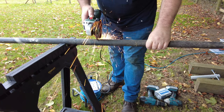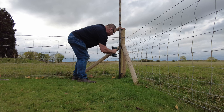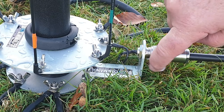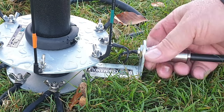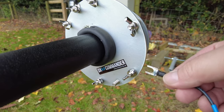I used an old sailboard or windsurfing mast to support my inverted-L. An interesting tip: 48mm scaffold tube (just under two inches) slips inside windsurfing masts — they often come in two sections, so you can get your eBay seller to ship it cheaply. A last tip: lots of people use Vaseline to protect against the elements when it comes to the SO-239 connector. It works for me, though fancy silicone solutions are available too.